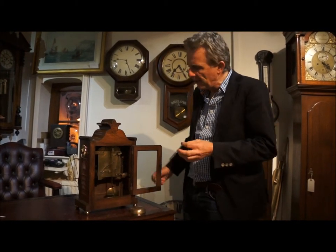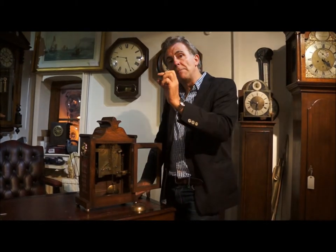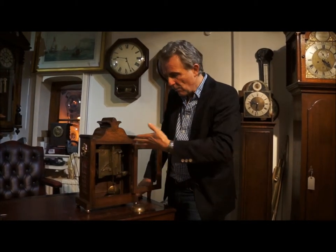It's got to sound like a metronome — tick tick tick. If it's not ticking evenly there are ways of sorting that out. If you take it to a clock person like myself, sometimes the crutch area down the back needs to be bent to make it work evenly and to get the escapement level.